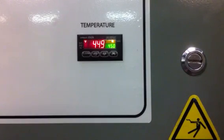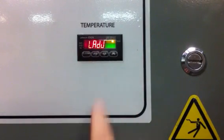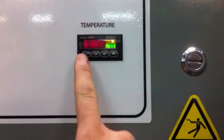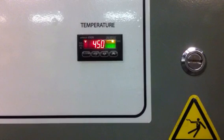After you've got everything set, you want to tune the controller. Press the gray button one time, press the circle button one time — it shows AT off. Hit the green button until it shows AT1, then hit it again and the AT will start flashing.